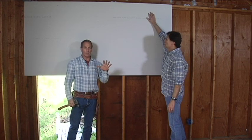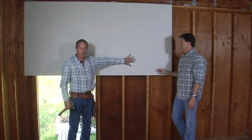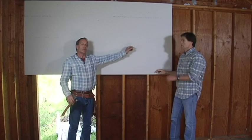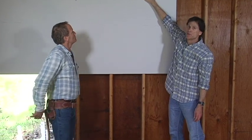So now we've just nailed this sheetrock up. All that is doing is just holding it, but you don't want to nail off the whole sheet. You'd rather screw it — screws will not pop out later. Nails will. And when you're nailing off the sheetrock, you want to make sure the nail just goes barely past the surface of the sheetrock.